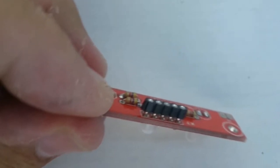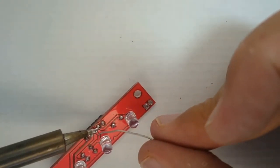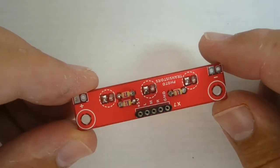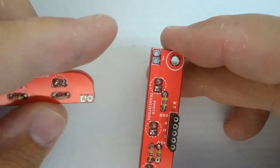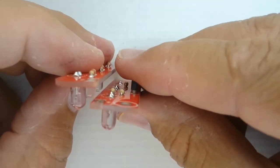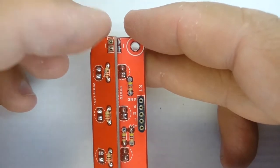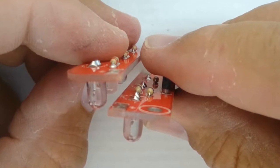Once you are sure the part is properly located, solder all the other pins. Remember to clean the tip of the soldering iron on the wet cellulose sponge every time you pick it up, before applying it to the board or parts. Now we have finished the two halves of the line following module. It is time to join them together at a 30 degree angle — the white LED transmitter board with the rounded leading edges will sit slightly above the square edged phototransistor receiver board, with both sets of components pointing downward at the maze surface.